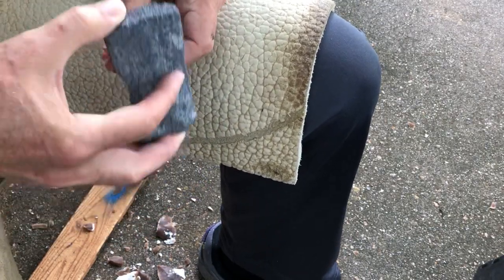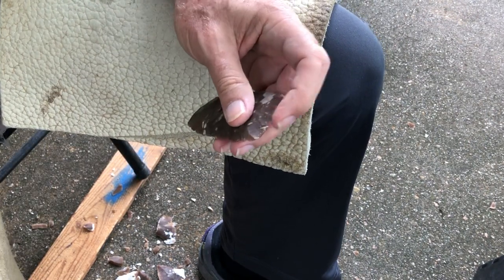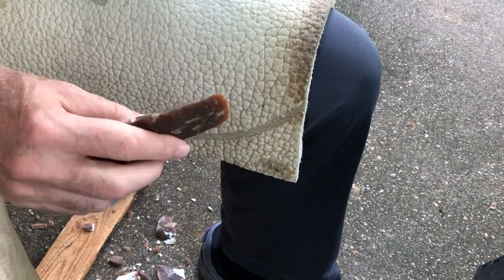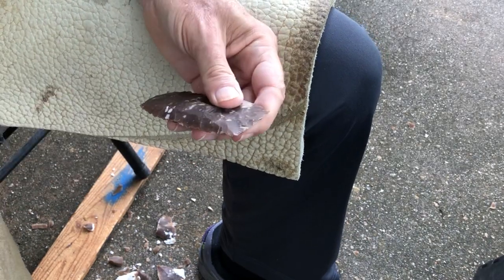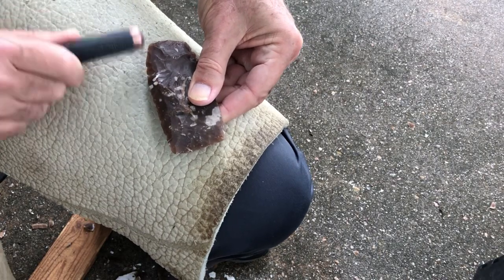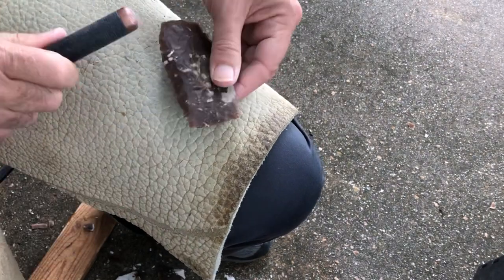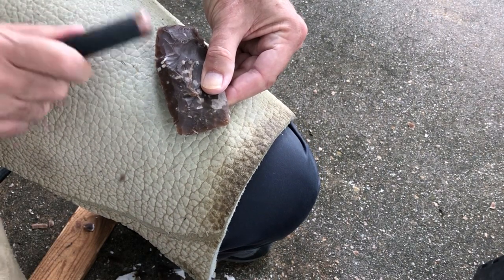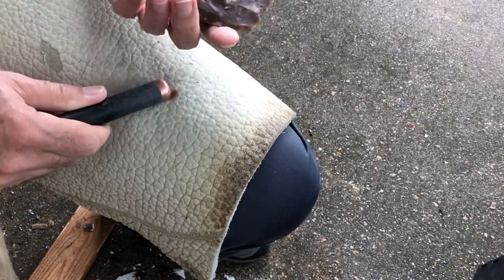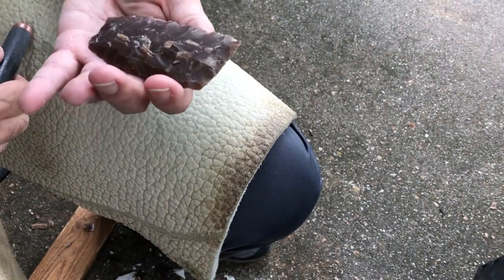Another thing too though is if you get your edge, your end, kind of sharp to start with and don't have it real rough, then when you do stuff later it's less risky because you're not putting as much force on it when it's thinner. And again, when I do this, I usually use kind of the corner of it and I hit inward a little bit at an angle. And I'm going for a clean underside to it without a bunch of hinges.